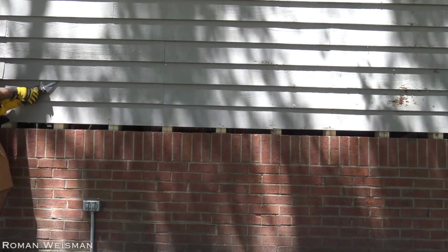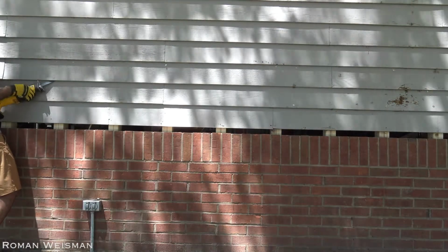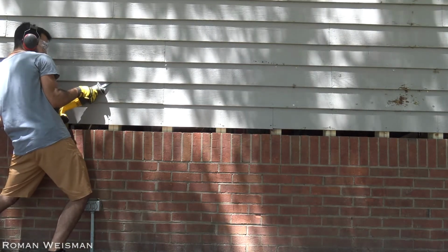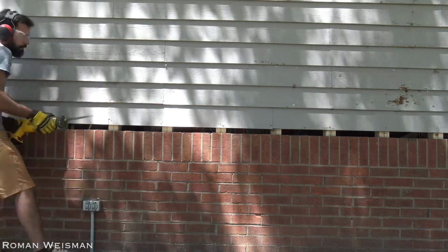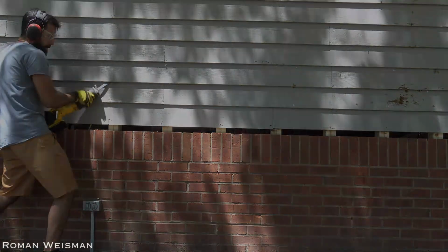I found that removing cedar siding can be done by gently cutting the nails with a metal blade, then extracting the nail heads by tapping with a hammer around them. The other approaches I tried always broke or cracked pieces I didn't plan to replace.